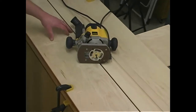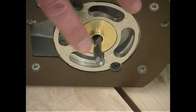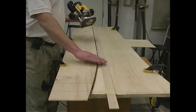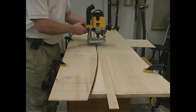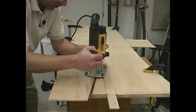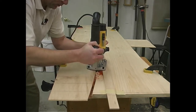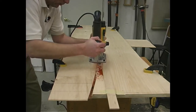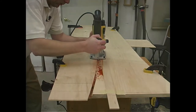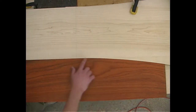To machine this joint I'm using a ⅜-inch solid carbide up-cut spiral router bit for a nice finish. I've added another strip of ¼-inch plywood to help balance the router during these cuts. I'll take a number of 1/16-inch deep passes until cutting all the way through — taking shallow depths greatly minimizes the potential for the bit to grab and the router to self-feed. With all the machining done you can slide the board in place and see a nice tight joint all along that seam. I'll do the same on the other side.